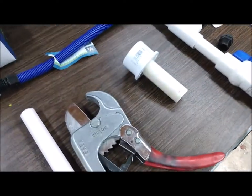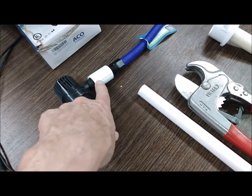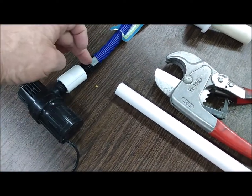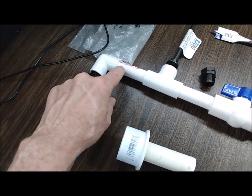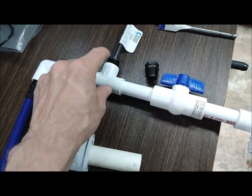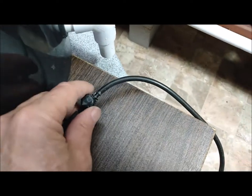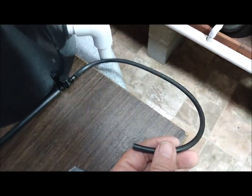Here is the whole system in a nutshell. You have a pump, and on that pump I'm using a threaded union — half-inch female thread on both ends. The line screws into it and into an elbow, which is female pipe thread to slip. My feeder pipe is all half-inch PVC with slip on each end and a threaded female pipe thread that goes to my riser. On the end of that riser I've got one of these little drip valves, and I put in my tubing which goes directly into the bucket.